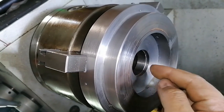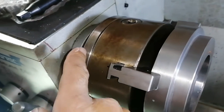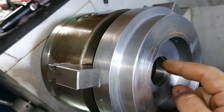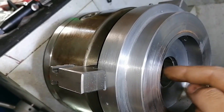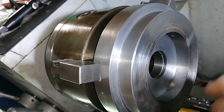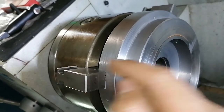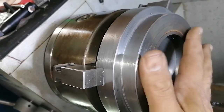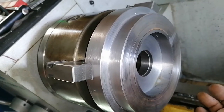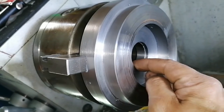Then I'm going to bore this section. Some of you might be wondering why this is back in the chuck — the simple reason is that for this bore here it's 40 millimeters, I must make this 40 millimeters, but the chuck throat is only 38 millimeters — actually the throat of the lathe is only 38 millimeters. So I'll just bring it out and machine this. I can always put it back on at the back and true it up, or maybe just leave it bolted to the chuck — I'll see which one centralizes the best. Now I'm just going to face this and do the boring.